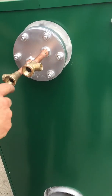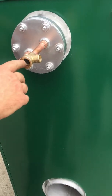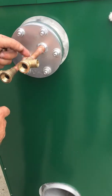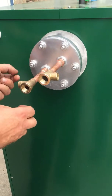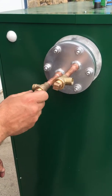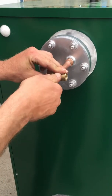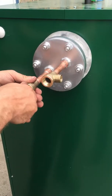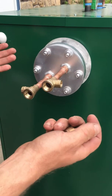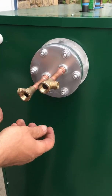This is in case you ever have a blocked coil, or your coil becomes sludged up, or you get dirt in. You could put a boiler drain in here and flush this coil without needing to cut your pipe and creating a whole mess. All you do — we put two half-inch plugs in here. If you ever need to flush your coil, you remove these plugs, put two boiler drains in, put your solution in, flush your coil — voila, you're done.